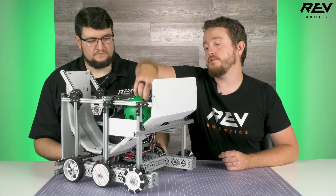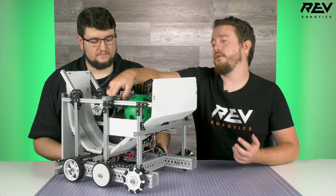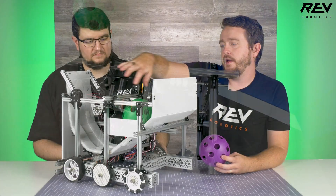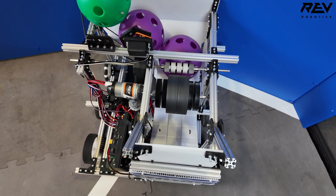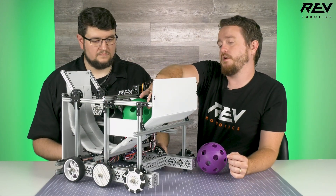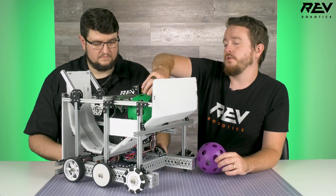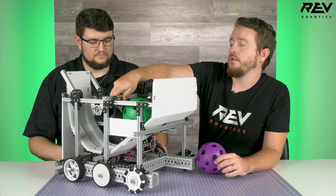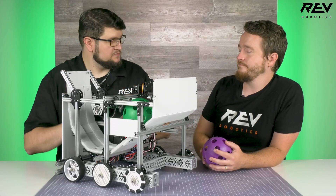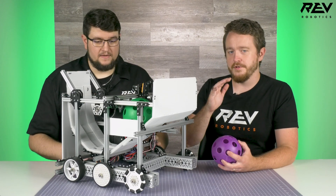This is a feed roller and it works against the chute. The feed roller has two flap wheels with the flaps almost all the way cut off so they can bite into the artifact. The feed roller, as well as the chute, helps center the artifact into the launcher. To keep the centering on the bottom, we've added two sheets of corrugated plastic that act as rails, so if the artifact is off to either side, it'll naturally get pushed into the center. Every single shot should be the same — that's the goal.